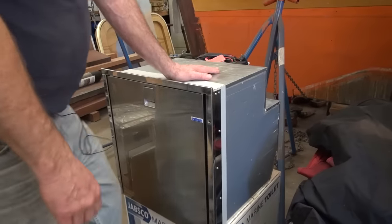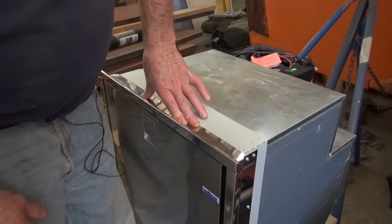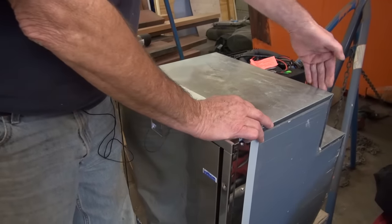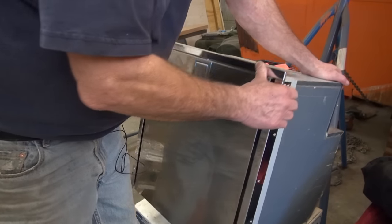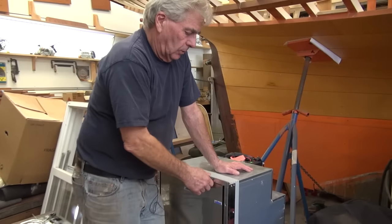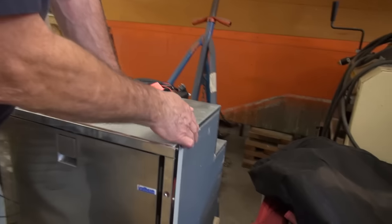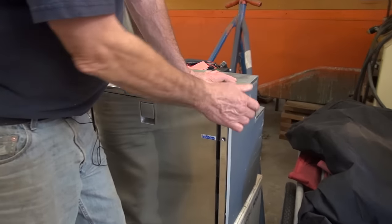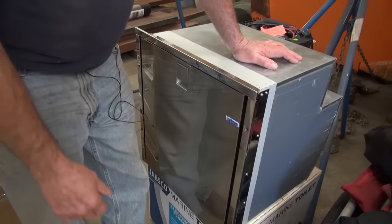This top shelf, when you screw it down into the cleats, presses down here and keeps pressure. There's a little cleat here, so when the boat's heeled over to port, the fridge can't move. The rubber feet are let into little detents. Then the fascia is screwed in here, and we have cleats on both the top and bottom shelves that keep the fridge from shifting fore and aft. Great — it should be a brand new thing for us to have the refrigerator. Getting close.